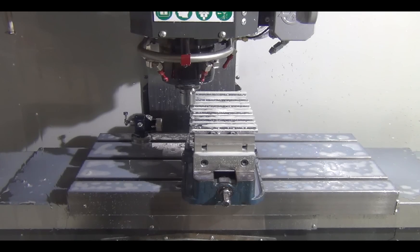The AB tool is in the spindle, and one other advantage is this tool has a very low spindle load. When we're cutting, the spindle is not working hard — the highest it goes is eight or nine percent, and finishing it's at three or four percent. We're not overworking our machine. Machines are mechanical devices; these spindles will wear out if you run them too hard. Compared to the other tools, which have a 30 to 40 percent spindle load, this does the same job in the same amount of time with less stress on the machine.